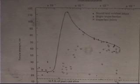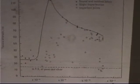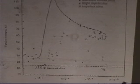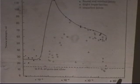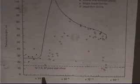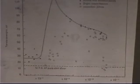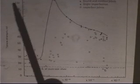The thinner the joint, the stronger the joint, at least in tension, and we'll go through this in a little more detail tomorrow. But this comes out of the Brazing handbook, and this is the joint thickness in inches, on a log scale, so this is 10 thousandths of an inch, 1/1000th of an inch thick, 1/10 of a thousandth thick, and here it's getting to be millionths of an inch thick. As you get thinner and thinner, the joint strength goes up to over 110 KSI.